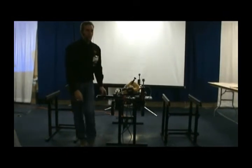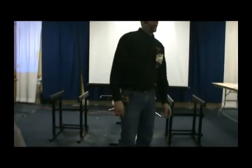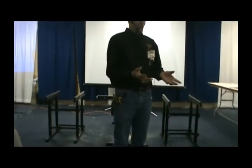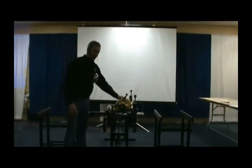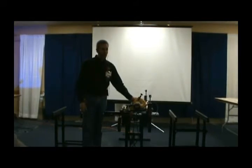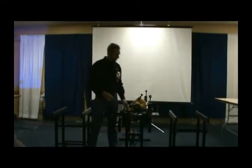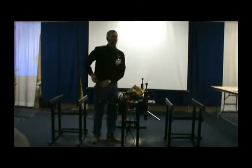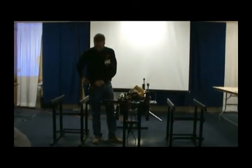So when you cross cut or you rip, you use the same blade? Oh, well, you shouldn't. When I'm doing fine work, I use a cross cut blade and a rip blade. As we all know, the saw in a lot of cases is secondary to the blade. The better the blade, the better the cut. This is fine cut for ripping. I kind of use it in these demonstrations for everything, but you're right. We should really change it for the cross cutting if we want good accurate work. However, I'm not going to do that today because I don't want to take up all your time.